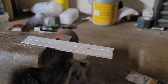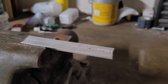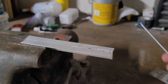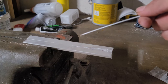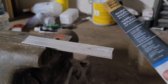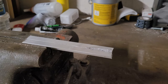Now we have to wait for this to cool before we can have a closer look at it. These are technically not welding rods — it says brazing and welding rods because this melts at a lower temperature than the base metal, so it's technically brazing, similar to solder. This means that though this joint is strong and perfectly fine for something like repairing an aluminum window or even fixing a leak in an aluminum boat, never use rods like these for any structural or critical application. Don't use this on something that could cause injury or damage if it fails, because it is not structural grade.